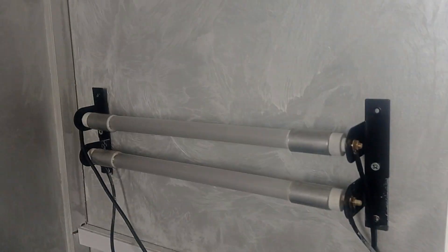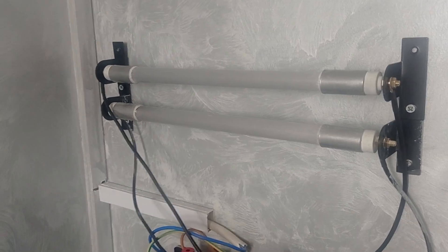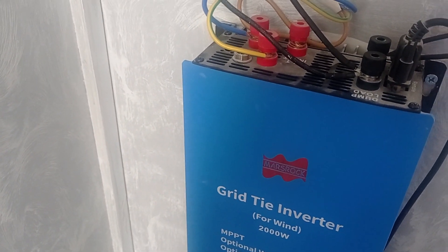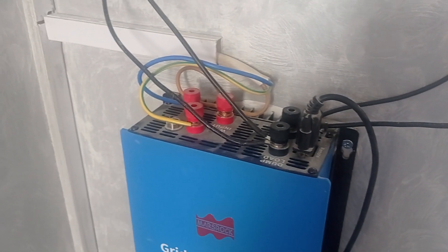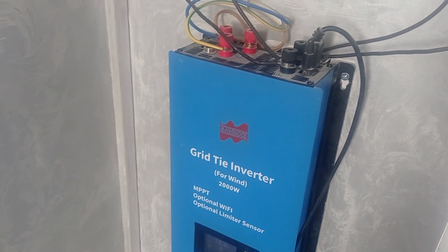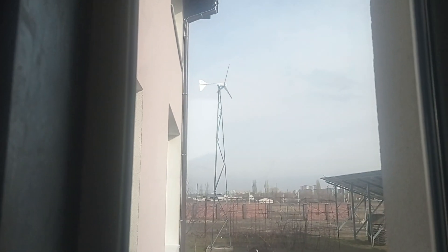With 5 ohms in my current setup, even at 100 volts that's only 20 amps. This inverter has internal breakers rated for 30 amps max, with a practical limitation of around 25.5 amps. Just bear in mind you must limit that amperage when connecting — and it will brake really nicely.